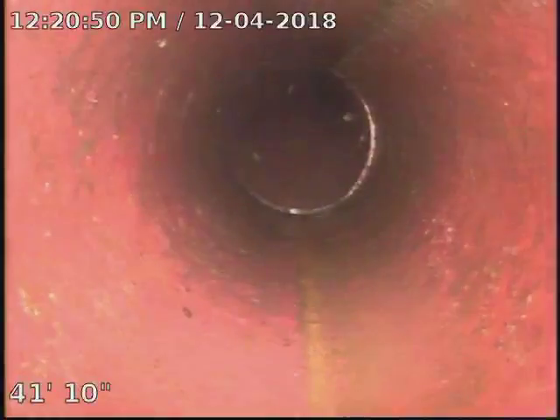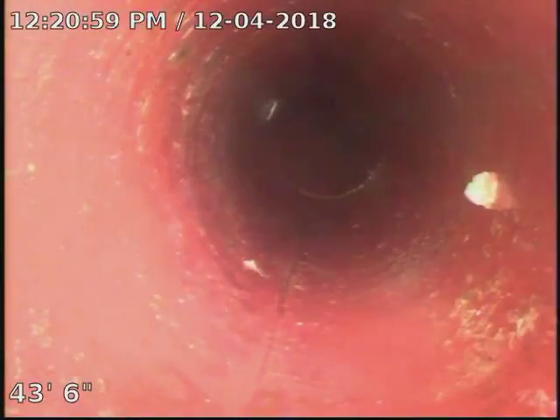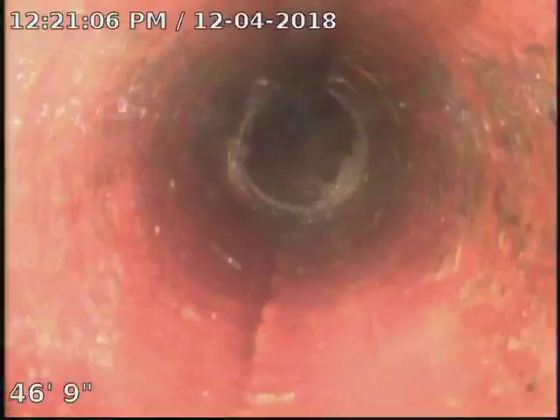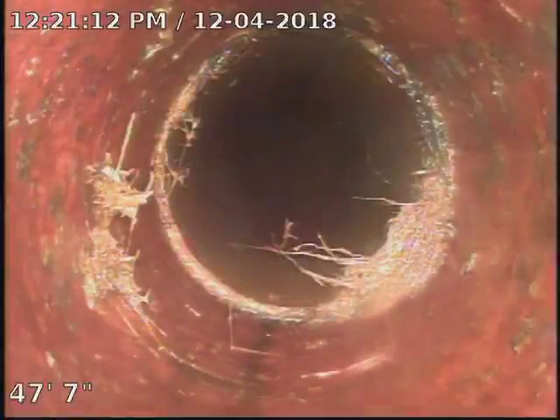A little bit of roots. I doubt that was probably a crack in the pipe. Go ahead and let's see how long the intervals are — if they're 3-foot intervals or 6-foot intervals. Looks like it's about a 3-foot interval. Or we've got a crack in the pipe. We've got some pretty good roots into it. That's probably our stoppage right there at 47.7 foot.